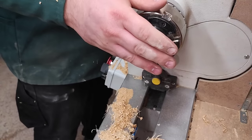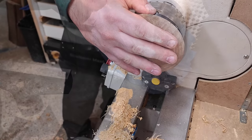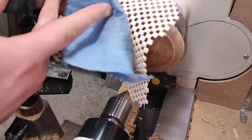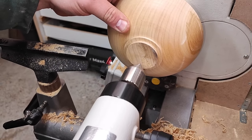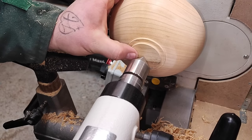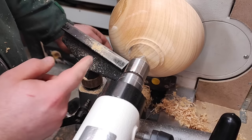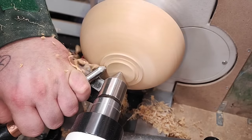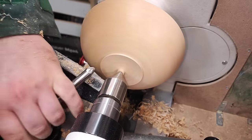I have these blocks of timber with the tenon on where I can rest the bowl. Okay, so this non-slip cloth, and I put the paper towel because it likes to leach. It's like it's wet, so I like to put this just to not stain the wood. Okay, that's center enough. So what I'll do is remove the tenon here, and then I'll fill these remnants of the bug hole. But it's good enough.